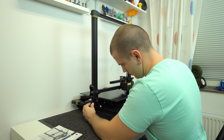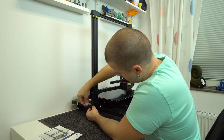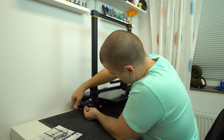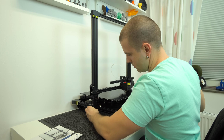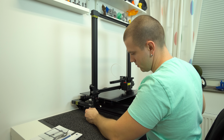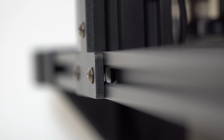Next, on the bottom frame side, where the upper frame meets the bottom frame, I install the frame brackets. The speed is crucial here if you want all T-nuts to open and lock inside these extrusions. Test screw by screw and recheck them, are they actually open inside. Here is how they should look when they're installed correctly.